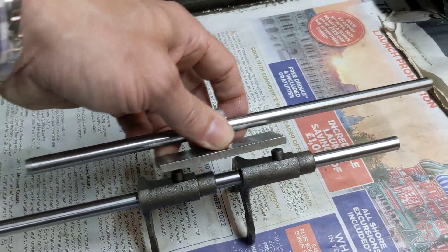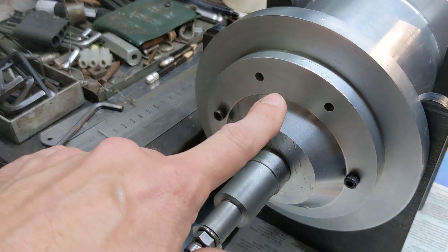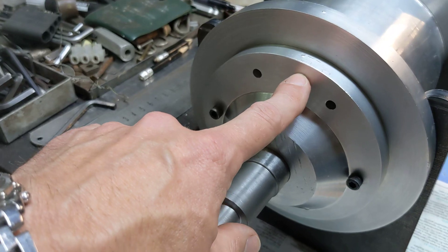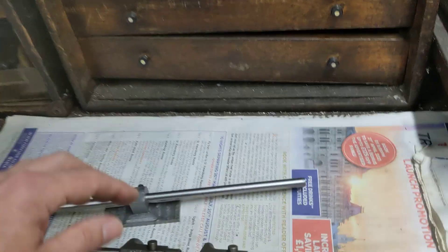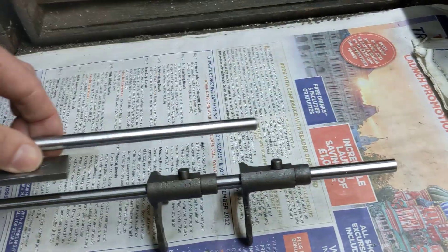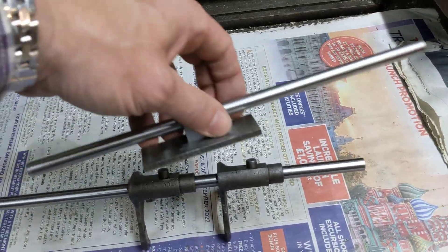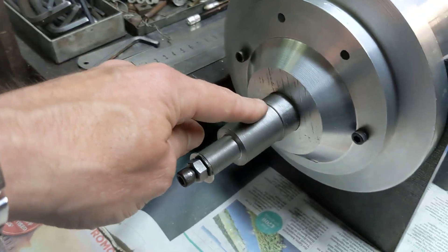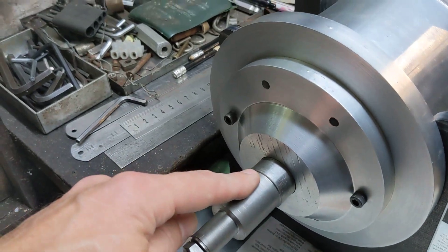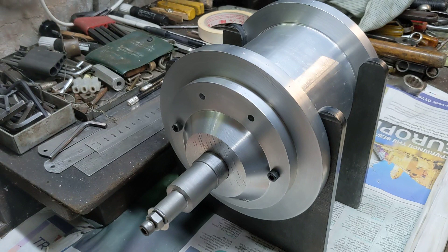This shaft also needs to be located in holes in the end plates of the gearbox, only this time the hole goes all the way through the end plate on this side and all the way through the end plate on the other side, so that the gear selector mechanism - whatever I decide to fit on the end of here - can slide that shaft. That shaft also needs to be parallel to this shaft and parallel to that shaft, but they all have to be drilled and marked out from inside an enclosed space, so there's a bit of head scratching going on.